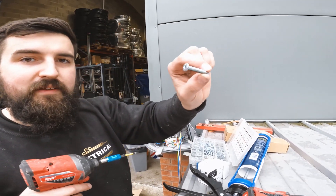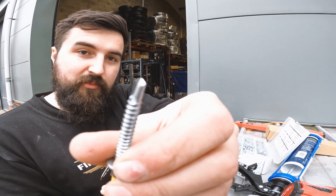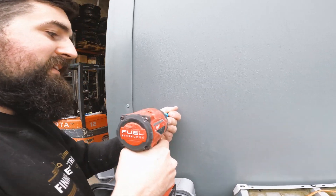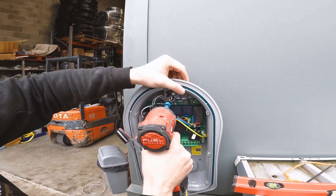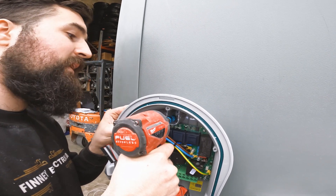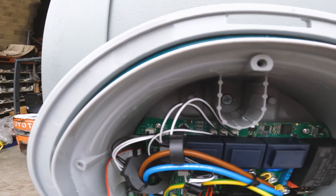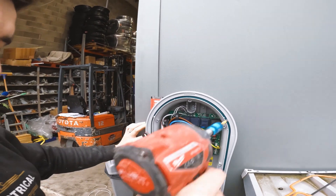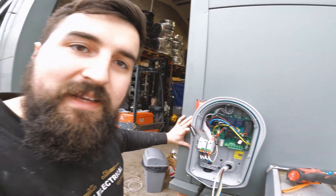Alright, we're just fixing it now. What we're going to do is get these fixed in, get it all nice and level, then pull it off, gunge it all up, and stick it back. I find it a bit easier to just get things spot on. It's a self-tapping bit for the metal - it's got like a little drill bit on the end and then it should self-tap straight through. Let's go through the cladding first, get that spot on. Afterwards I'll pull this off and get it all gunged up with loads of silicone just to seal everything up. Check the building's level - and it is, that's good news. Just level this up, then get the bottom two fixings in and that'll be it mounted nice and solid.